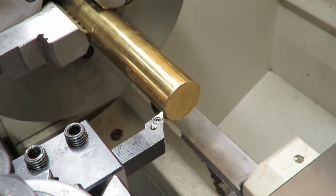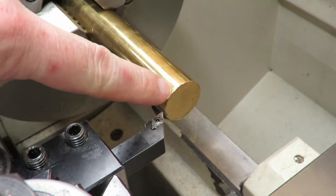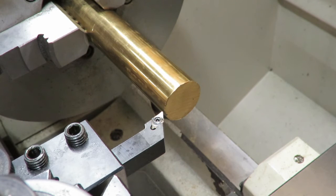And then once we've done that, we can cut the taper in it, and it's going to be 0.860 up by the rim, and out on the end here it's going to be about 0.845 roughly. And then after that, we can move to boring out the inside, and we'll just drill it out to as close a diameter as we can get. And then after that, we'll take the boring bar and shave it out to the appropriate diameter.